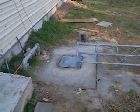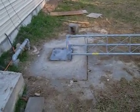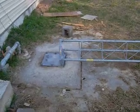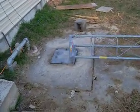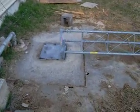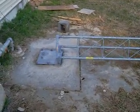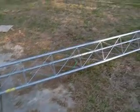As you can all see, the foundation is finally dry. We've had nothing but rain since we poured it — this is the first weekend without any rain, and we just got rain up until yesterday morning. So it's taking a while, but concrete does cure stronger when it takes longer to cure. You can see there's still a little grayish color instead of being nice and white, so I'm gonna let it ride for another week before we attempt to bring the tower up.